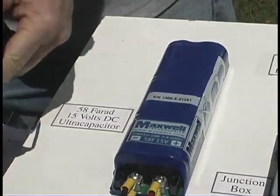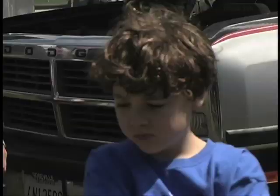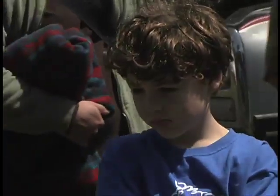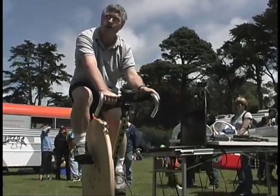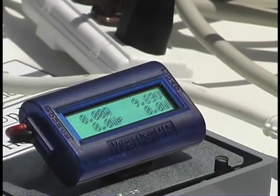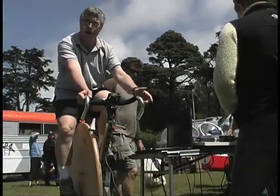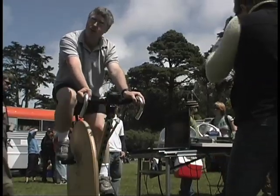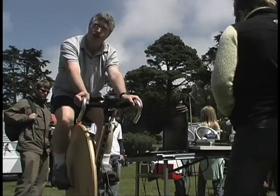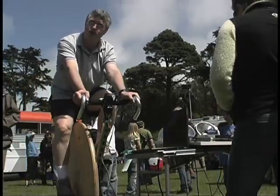No battery in this setup — this is all just straight juice and the capacitor going in. It starts off kind of slow. You can see how much power is being generated on that little purple meter down there. Just cranking up — there's a capacitor here that I have to charge before I can do any work. It's got to get up to 12 volts, or up to 7. So I've got to take it easy in the beginning until I get up to normal voltage, and then things can be turned on.